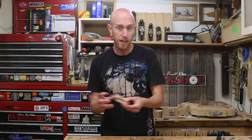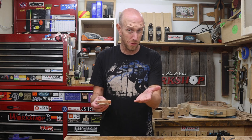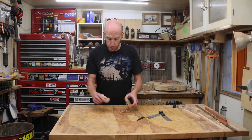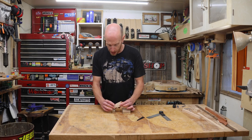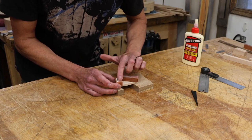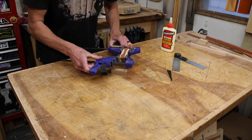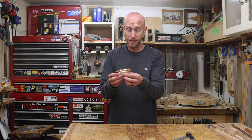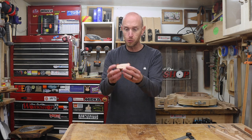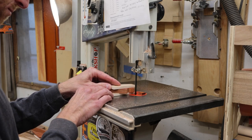Now we are ready to glue on our second side. This can be a little tricky to get everything lined up. I've tried trimming off the excess first on some of the practice ones, and really as long as you can get the bottom edges registered together — if you've got a couple scraps of wood that are the same height, you can use those as makeshift gauge blocks to hold everything in alignment while you get it clamped up. Now that our glue is dry, this is where the real fun begins — now we're going to shape it. I've got a lot of extra material to carefully cut away at the bandsaw before we take this to the belt grinder.